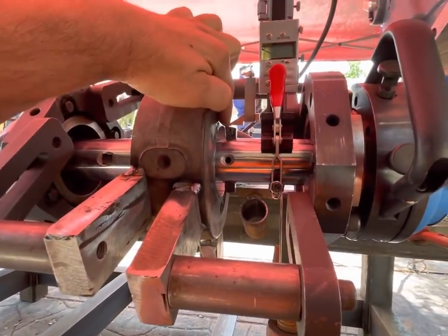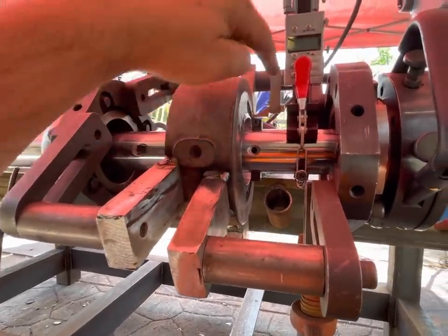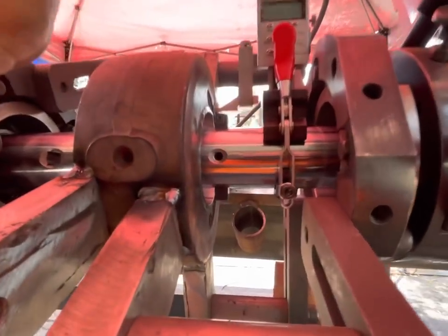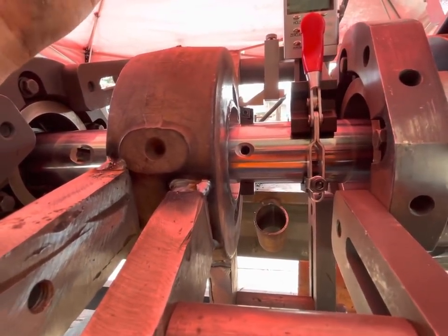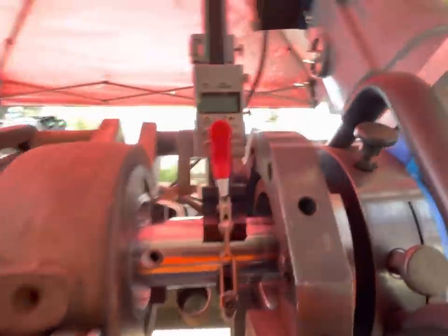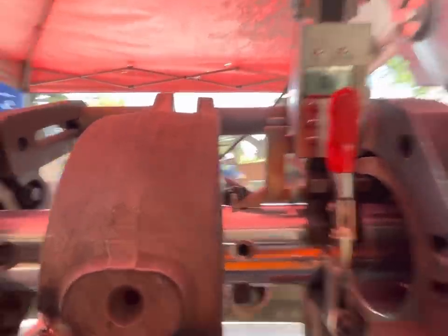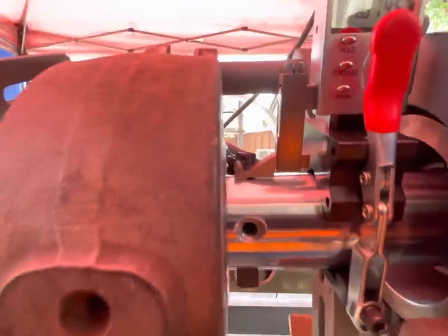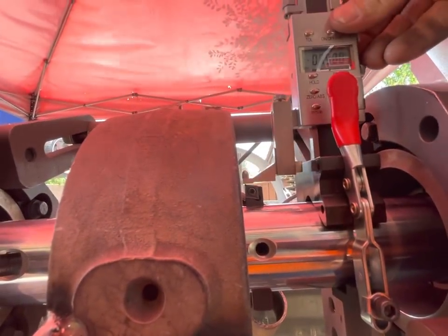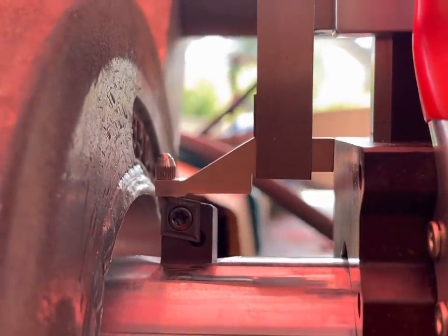So from the very tip of your insert, if it makes a full rotation, that would be the correct size. So if you assume your bar has no deflection, which if you're only taking a couple thousandths on a pass, it would be very minimal to none, especially with a 2.25 bar. So you simply turn it on, touch the bar, make sure there's no debris in there, zero it, move it back up, so it's touching the tool bit holder.